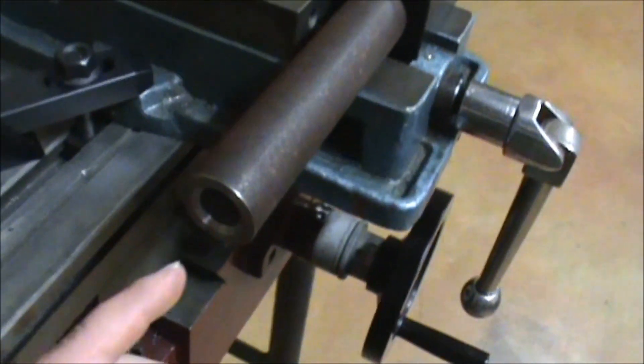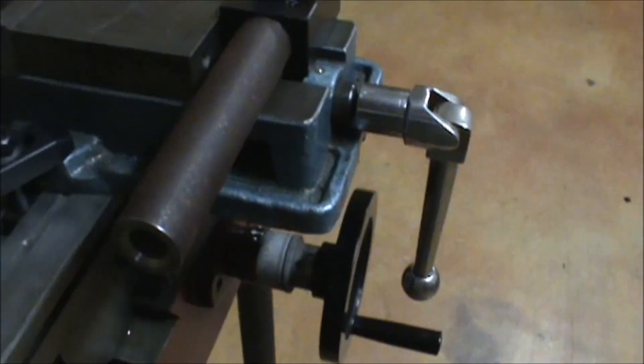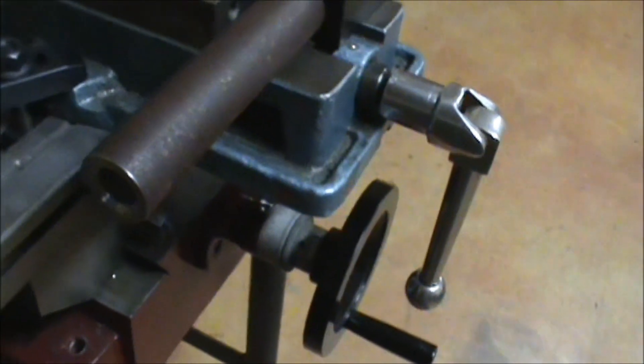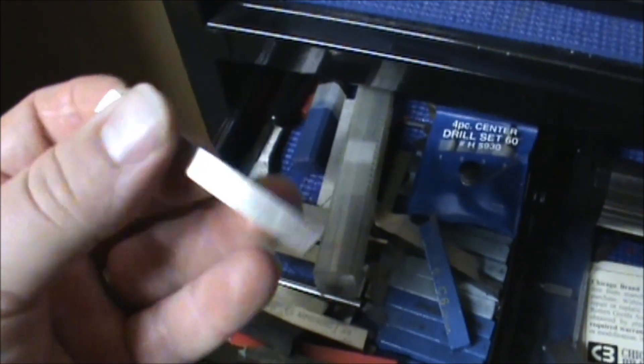I'll be able to change out that head - I can make another one, just cut off another button that has a bore, and I can put different tools on it and still have a nice long boring bar, a pretty rigid boring bar. I'm going to be using high-speed tools, a quarter-inch tool bit, and that's going to be put in with some set screws. I've got some set screws from McMaster.